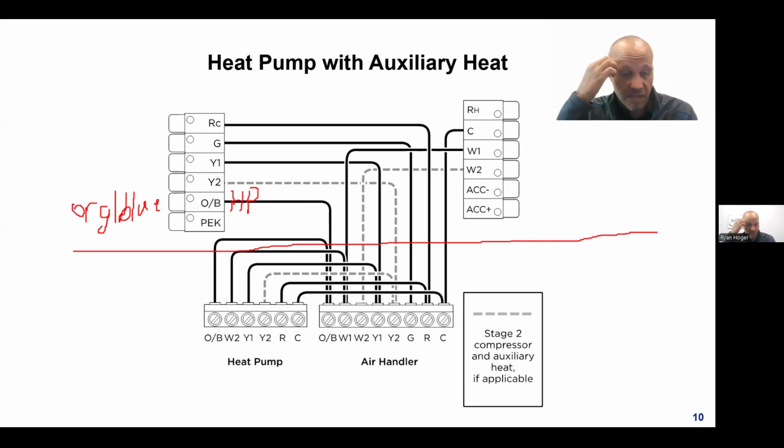On a modern thermostat from any of our vendors, it's O/B. They are combined into one because you would never need both at the exact same moment. They are combined into one, and then electronically we tell it which one we really want. Electronically means from the keypad or with a dip switch or a jumper or something behind the circuit board, something that says I want an O or something that says I want a B instead. The difference is that you have to know what your heat pump wants.